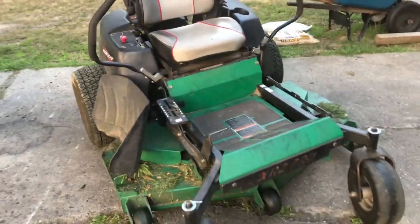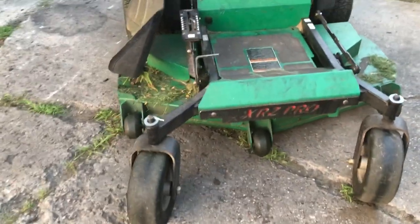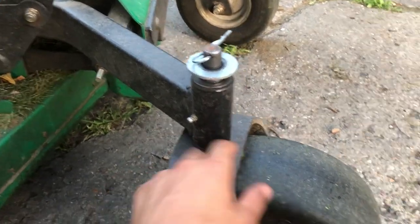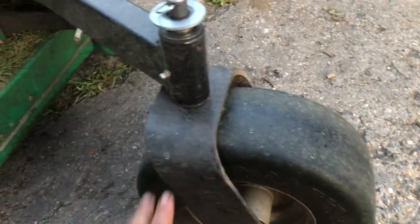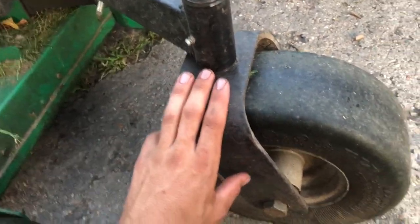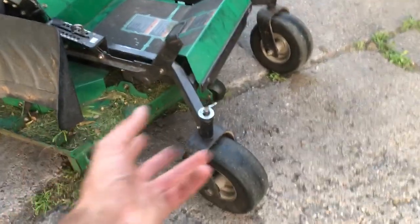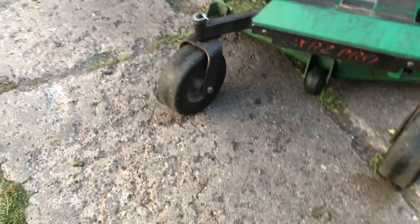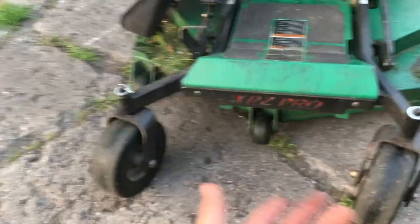This was a midline rider and I was using it for commercial mowing, so the mower took a beating. Some things I've replaced: the caster forks — the welding on there, there's a rod that extends up welded to a U-shaped bracket, and that went around $200, so I just replaced or re-welded them. The tires that initially came with the mower were inflatable, which are a pain in the neck — they always go flat. A lot of guys will poke holes in the tire and fill it with foam, but I just got solid rubber so I don't have to worry about it.